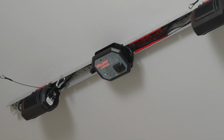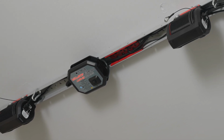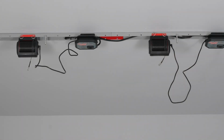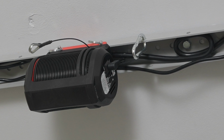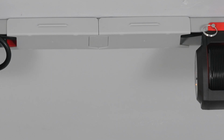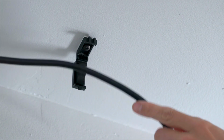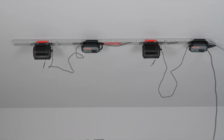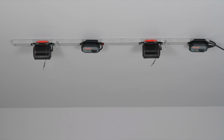The 2 MyLifters need to have 9 holes between them to properly lift the platform. Use the included 3-foot DC power cords that go from the power adapters to the MyLifters. Your MyLifters are now powered up. Your carabiners will go on the smart track in the holes next to each MyLifter. Use the included track covers and cable clips to make your installation look its best. This may take some time and patience to get everything tucked away.